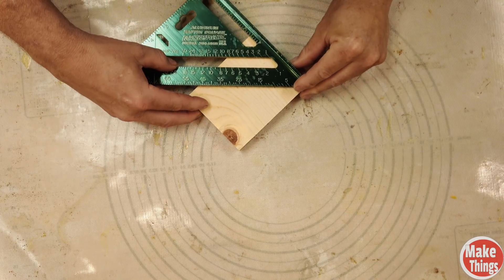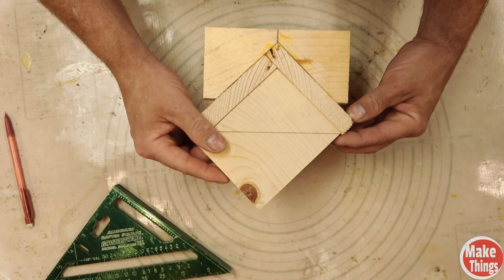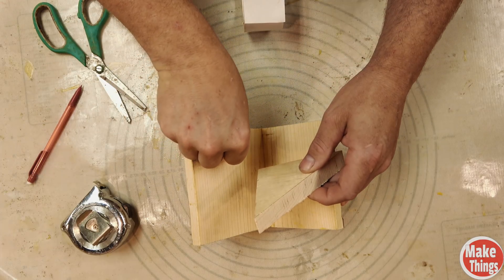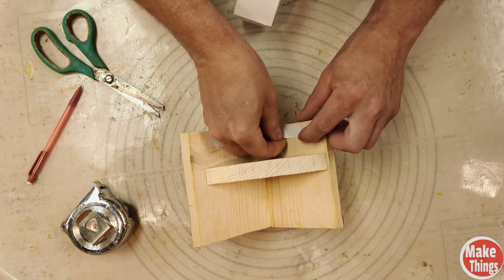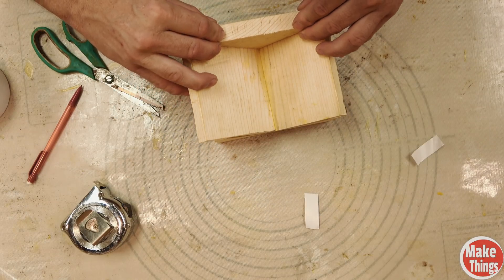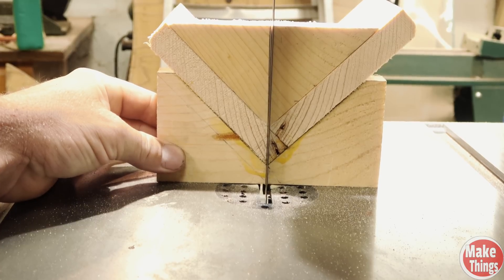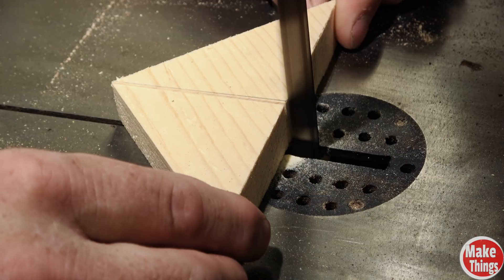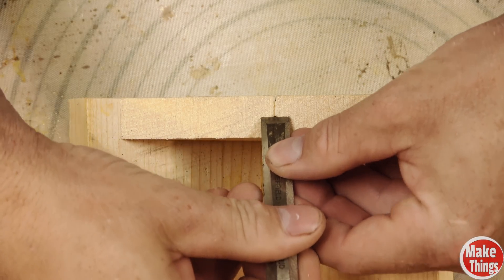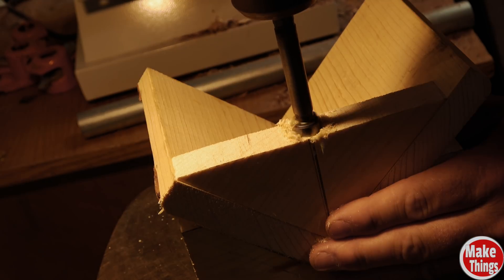While that's drying, I'm going to cut a triangle that will fit inside the sled. I used a little carpet tape here to attach the triangle and headed to the bandsaw to get a nice straight cut. If you take this approach, make sure you check that your blade is at 90 degrees with your table. After I made my points of reference, I found the center of the triangle and brought it to my drill press, where I drilled out a 5/8 inch hole — the same size as a spacer I'll be adding.